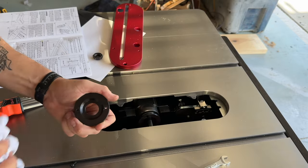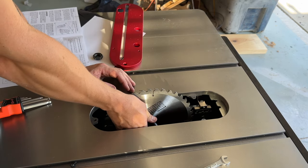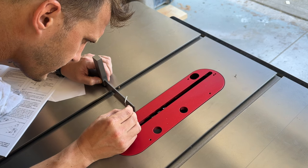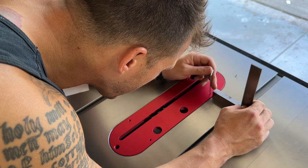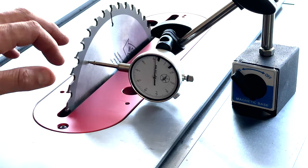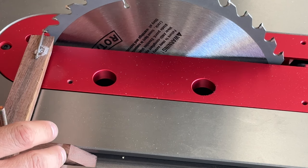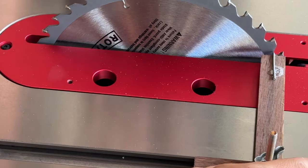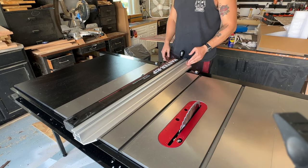Here I'm getting ready to attach the blade so I can begin truly calibrating the table saw. I've watched tons of videos on this — I've never calibrated a table saw to this degree before, but it's something I wanted to do correctly the first time. You will need to put a little bit of Loctite on the leveling screws so they don't vibrate out. I built a simple jig using scrap wood with a superglued nail to test that the blade is perfectly parallel with the miter slots, and out of the box, everything was perfect — did not have to adjust at all.